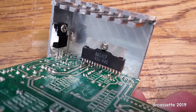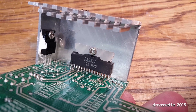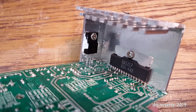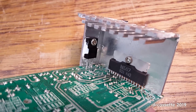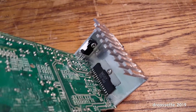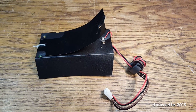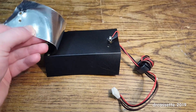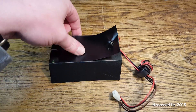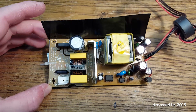This is a traditional class AB amplifier — a boombox-style stereo amplifier chip right there. Next to that is a 5-volt linear regulator, a 7805. So they had to put in a big heatsink, positioned all the way at the bottom of the unit where there is the most space. Here is the power supply taken out. This right here is actually some shielding, then some insulation, and surprise — this is a switch mode power supply, and not a bad one by the looks of it.